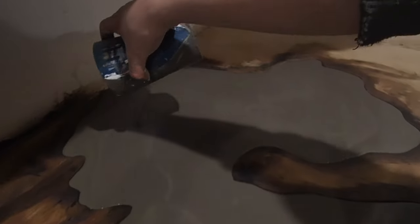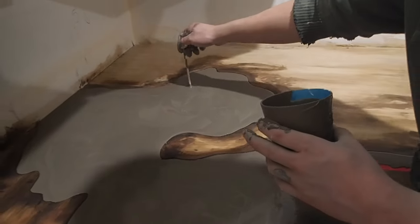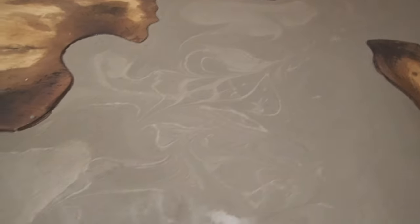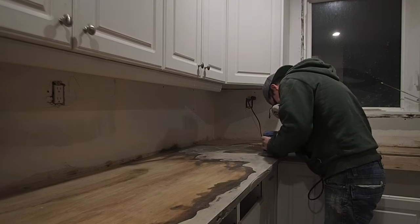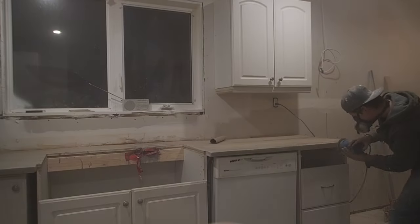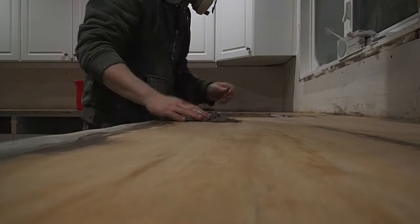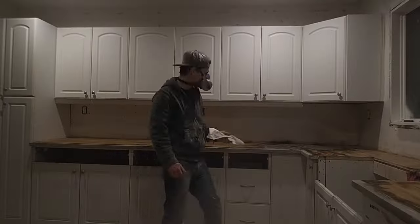What I'm using here is basically a self-leveling underlay for flooring. I made it up in several small batches with different consistencies of water. I really like it when the swirls are allowed into pieces like this — sort of similar to what you would do with epoxy resin. This is a different material, but the principles are the same. Then I sanded it somewhat smooth; I'd never worked with it before and it wasn't exactly the easiest, but it turned out pretty cool. After that, I basically just wiped it off and washed the counter several times until the water came out clean.